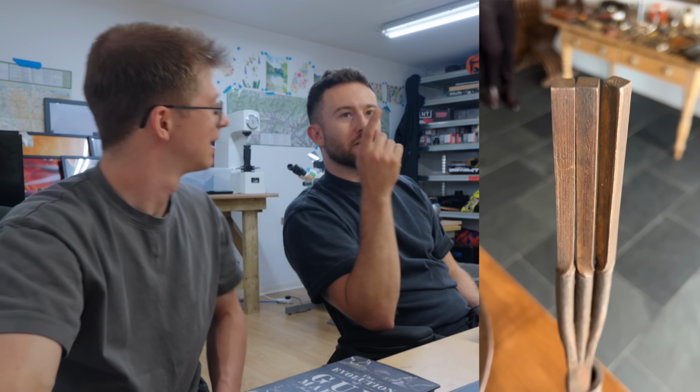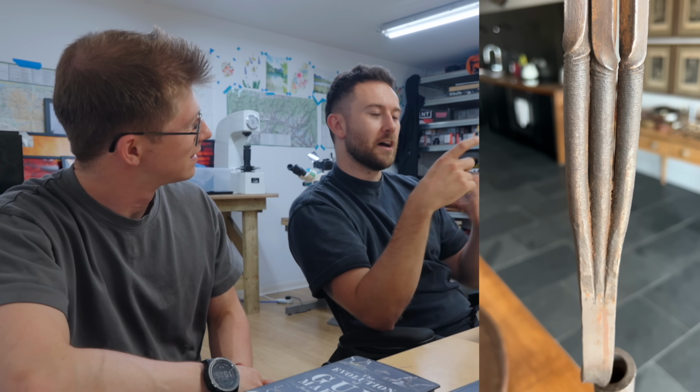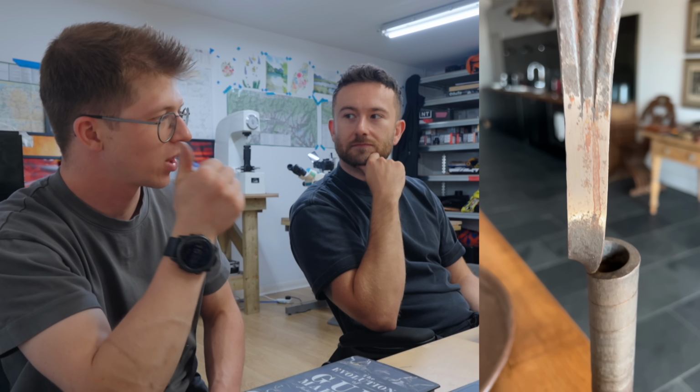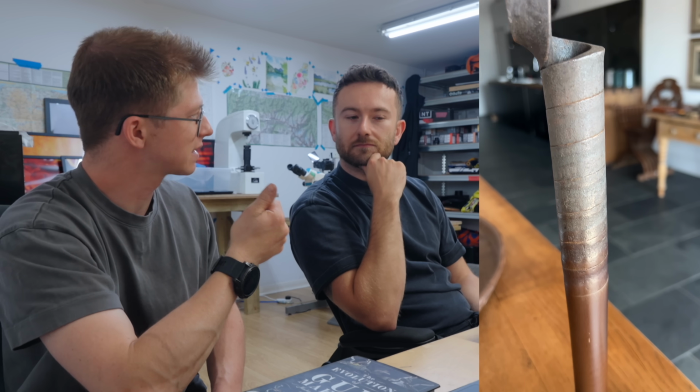What about the photo that we have from Wesley Richards of a barrel which is half welded and half twisted? I think that there's a number of things we could surmise from that. One, that might just be an art piece. Like, here's how it was done. Two, it might be that different blacksmiths did it different ways. It might be that some people spiralized it and welded it in as they went, and some people spiralized the whole thing and then welded it, coiled the whole thing.